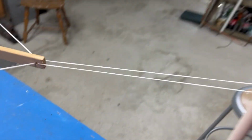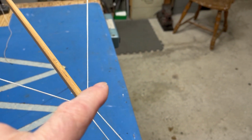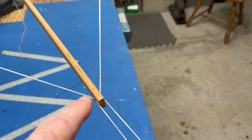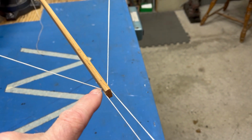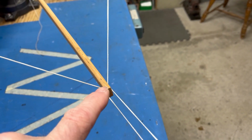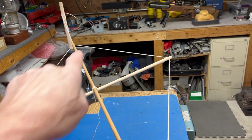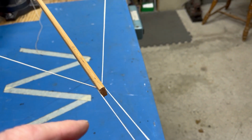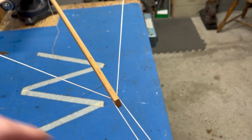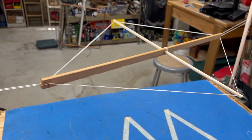So the termination resistor would be on this end. These two wires are not connected together in the real world. They come to this point and they're mechanically secured here, but there's a resistance in here. Now, if you don't put the resistor in, you're going to have bidirectional. It's going to be directional off the front, and it's going to be directional off the back. But by terminating this properly, you're able to get a really nice front-to-back ratio. Okay, so you'll see in the plots the gain pattern for this antenna